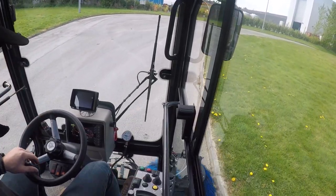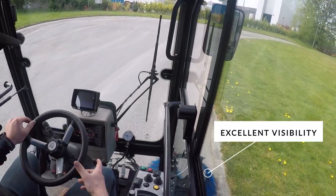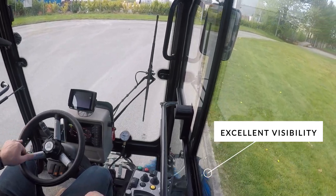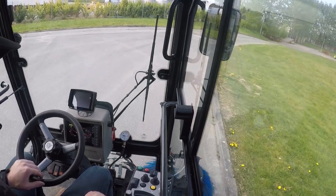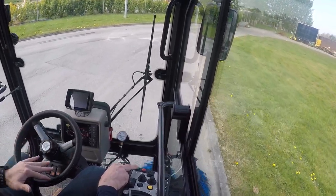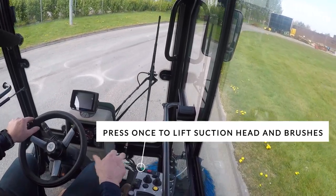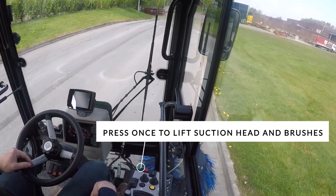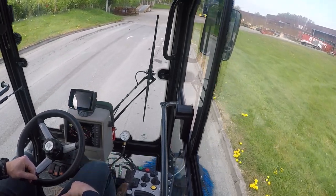I'll knock my cruise control back on so I can concentrate. I've got excellent visibility on the machine — I can see exactly where the brushes are, making it really easy to get the job done. If I want to quickly lift my brushes and suction head to clear a curb, I press the green button once: brushes turn off and the suction head lifts up. Press the green button again and they drop back down and sweeping resumes.